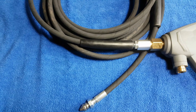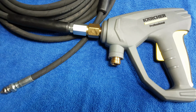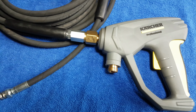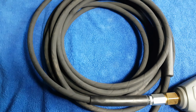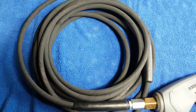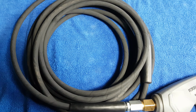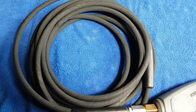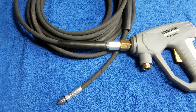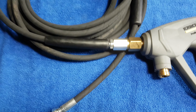Now you always test a jet and run the machine out of the drain. Always operate it via a trigger, because otherwise it's like a snake wafting around everywhere. This hose is a rubber hose, not a plastic hose, so it won't get damaged the first time it goes down a drain by getting caught in a snot that's down the drains or anything else that gets very sharp, with it being rubber. 1 wire. These are available in 10, 15, 20s, 30s, depending on what length you want, but this has got 1 wire braid inside there as well.